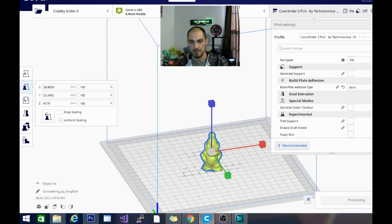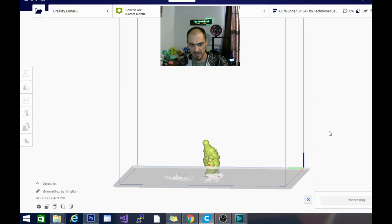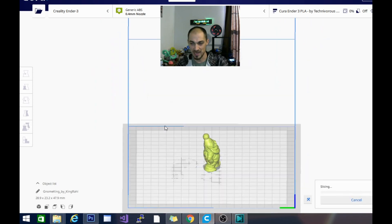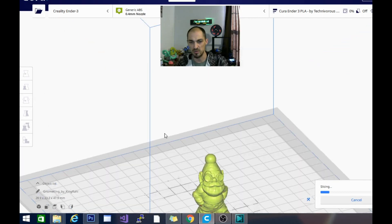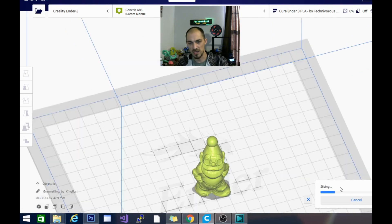As you can see, my model has almost no overhangs — one of the reasons I'm able to get away with printing it without support. You can use this technique with support, but you need to be aware that super steep overhangs on the top of the model — say if there was a giant flat area on top of the head — can sometimes cave in without infill. So you're going to want to judge this on a per-model basis. This one should print really well with no infill because it all seems to slope at gentle angles. Once we're done slicing I will throw this on the printer and show you what happens when it comes off.